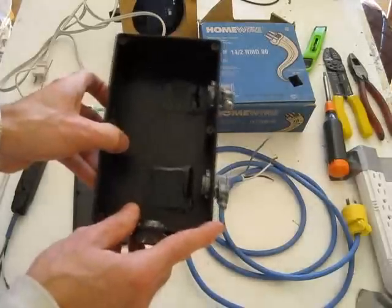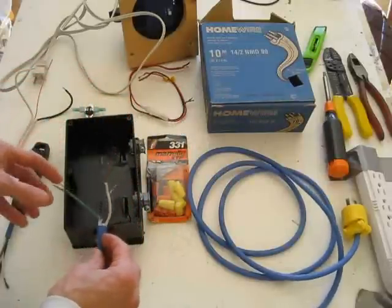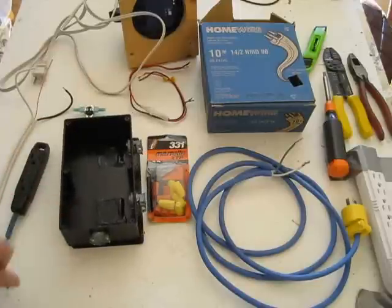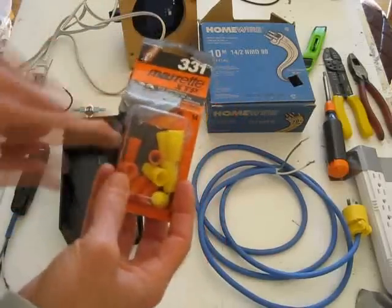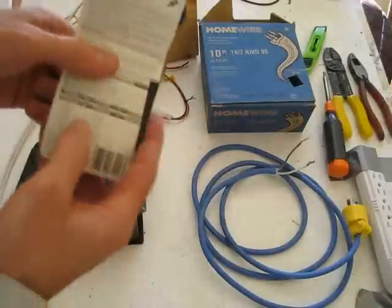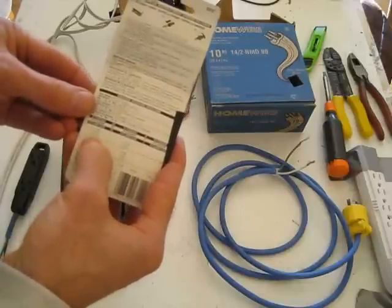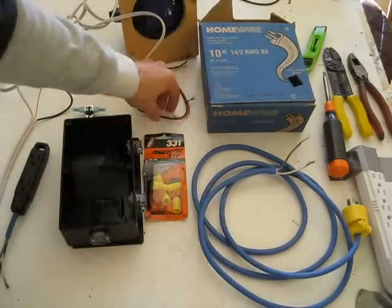If this is going to be a metal box, make sure to ground it. The wire coming from the wall socket has a green ground wire — just connect that to the metal case. That way if there's a short and the box becomes live, since it's grounded the short goes to ground and nobody touching it will get a shock. To connect things inside the box, marrettes are used — a safe method. The box indicates which wire gauges work: for the orange marrette, two to five 18 gauge wires, or combinations including up to 14 gauge. And lastly, there's the fuse.